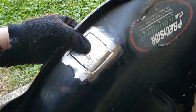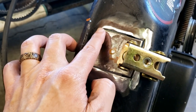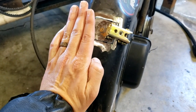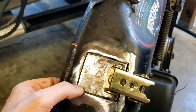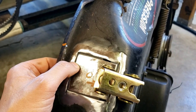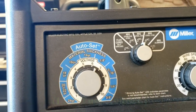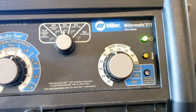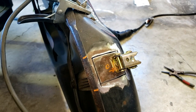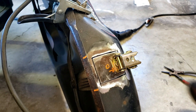It does curve up here a little bit - all I did was stick it in the vise and kind of bend it slightly. It's not going to be perfect but it's a lawnmower deck. The plan is to hit it from the bottom, tack it there, and I want this to be a little bit proud. I've got the Miller Matic 211 set at around 6.5 and I think it called for 70 wire speed, but I typically find that's a little fast for me.